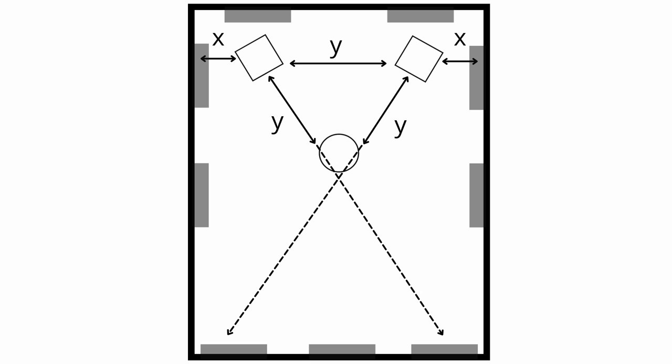You're also going to want to get those zones behind your speakers. A lot of people don't treat behind their speakers, but sound goes that way too. Also, don't forget above you. If it's in your budget, make a cloud — a sound absorption panel that sits above you — because if you put a mirror up there, you're going to see both speakers. So it's almost automatic. Get something above you and below you. Put a carpet down. I have this lovely shag rug. Anything to get something on the ground to absorb sound, especially if you have hardwood.